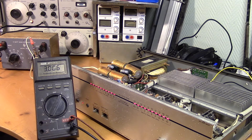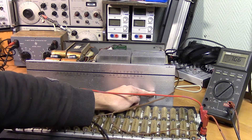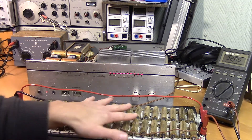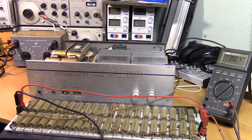Let's test it out. Now we have it hooked up once again — 32.5 volts should indicate 120 watts delivered to the load. It's certainly a lot more accurate this time. We can't expect 100% accuracy as this load is not exactly 8 ohms, but with this test setup it's probably as accurate as it's supposed to be. I'm pretty impressed with this thing delivering 120 watts to this load without any problem — it's nice to see equipment that delivers the power it's supposed to.